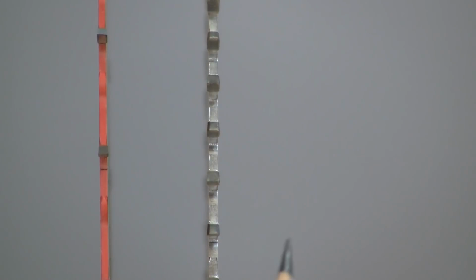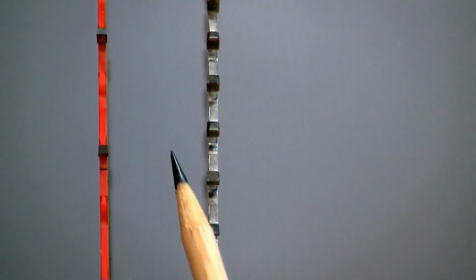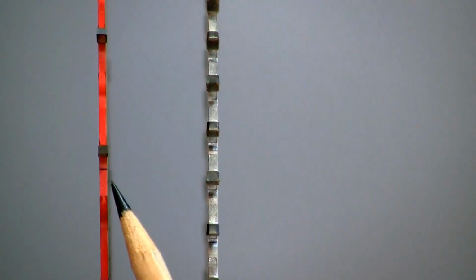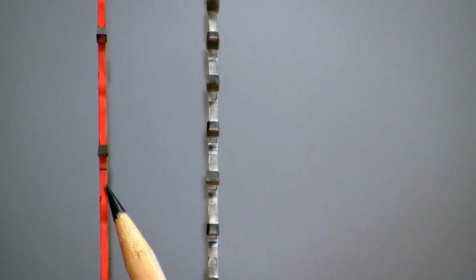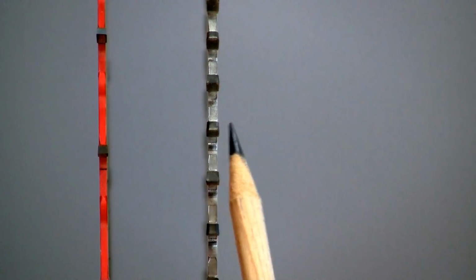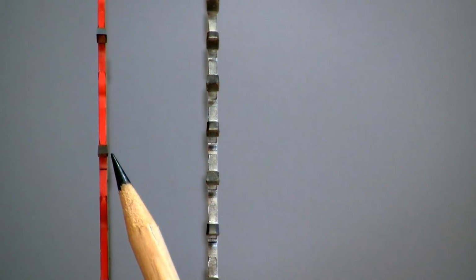The last thing I want to talk about today is how wide blades are, and they refer to this as kerf. And this blade here, this is what we call a full kerf blade, and they're typically, for our metric friends, a little over 3 millimeters. In imperial, that's about a full 1/8 of an inch. Now the blade next to it, this is what they call a thin kerf, and they're typically 3/32 or about 2.5 millimeters. And the difference between these blades, as you can see, there's a lot more carbide on a full kerf blade than there is on a thin kerf blade.